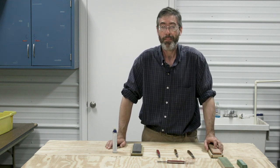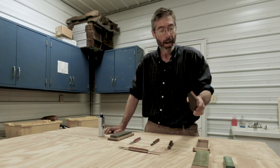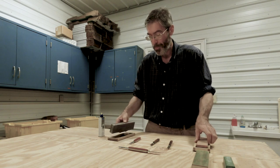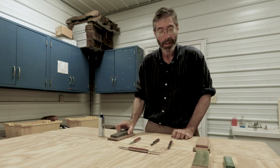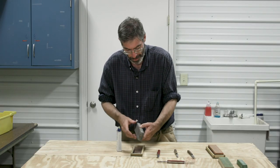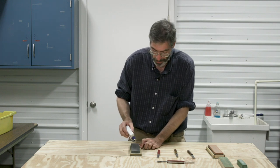If our grafting knife is very, very dull, we'll start off with a heavy grit, going to a hard grit on this side, then to a medium grit. Or if it's already fairly sharp, we'll go to a medium fine and then a very fine at the end, and finally use a strop to take off that last little bit of metal and polish up the grafting knife. These are already fairly sharp, so I'm going to start with a fine and just sharpen them up a bit more.